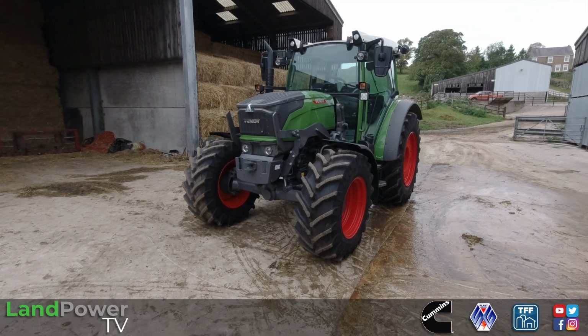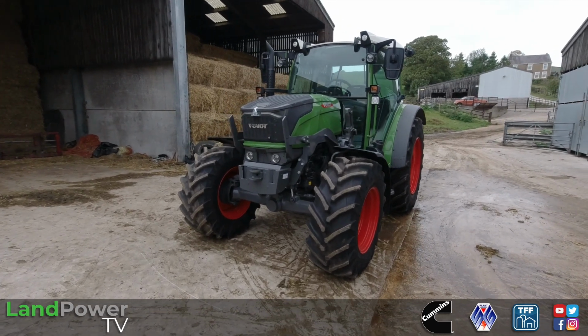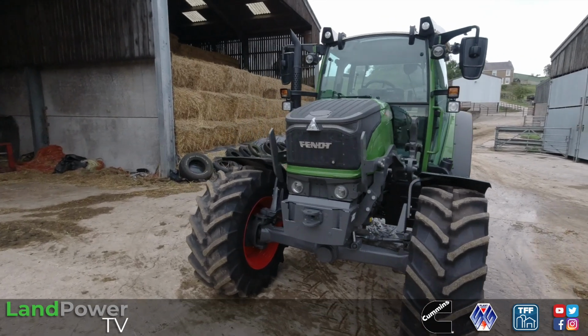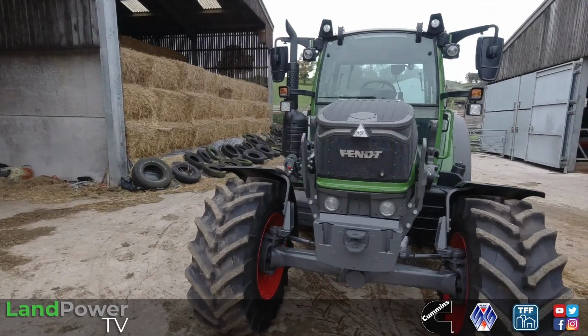Conversely, go back to the summer that we've had, where it was boiling hot, air conditioning running flat out, cooling packs running flat out, and therefore the extra 10 horsepower would start to feed in to compensate for those performance losses. What I call your parasitic losses. Got you. So the air conditioning unit could rob, you know, 5, 6, 8 horsepower, taking it away from your primaries, being your transmission, being your PTO. So dynamic performance will add in the extra power to compensate for those losses.